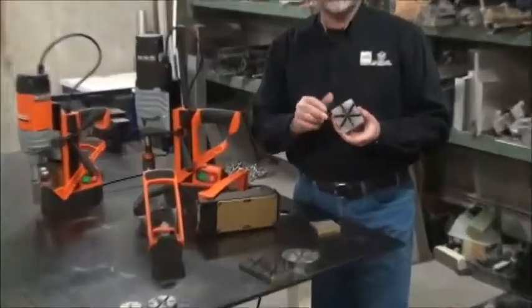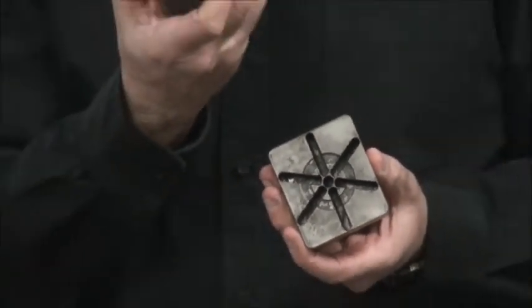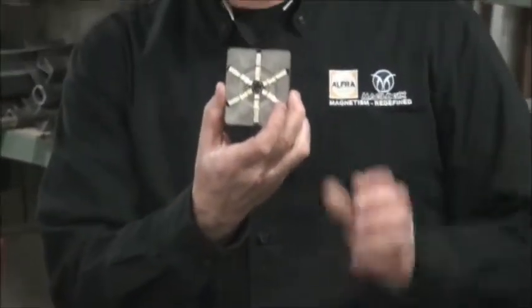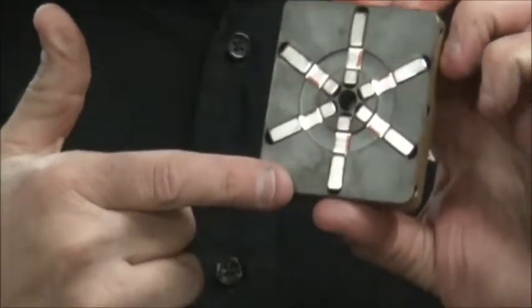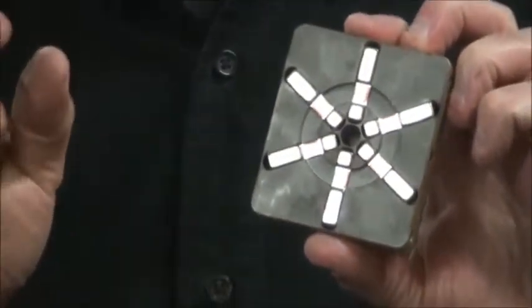Come on in here and take a look at the base of one of our magnets. We don't use one north pole and one south pole. What you'll see is that we actually populate each of these slots with a little magnet. Smaller magnets mean much greater efficiency — that's a huge advantage. Once you've got each of these slots populated with a magnet, you now create an entire section of this pie that's a north pole, a south pole, a north pole, a south pole, and so on all the way around. What this does is give you very small fields — the smallest magnetic fields ever seen.